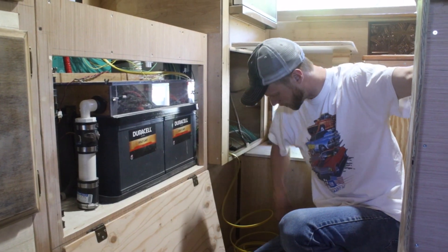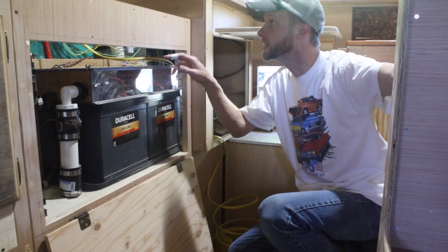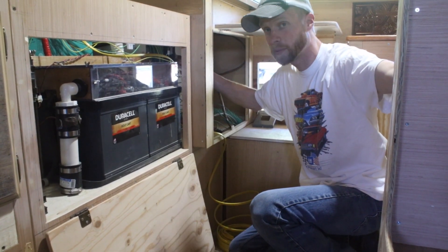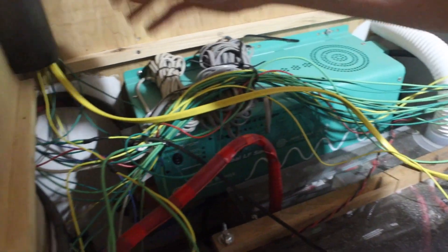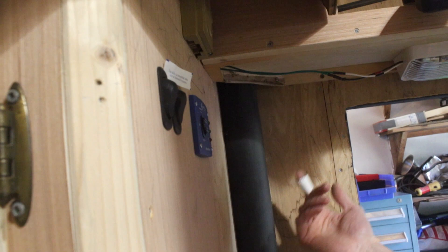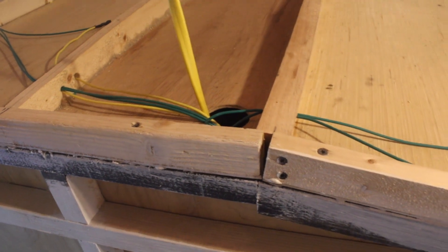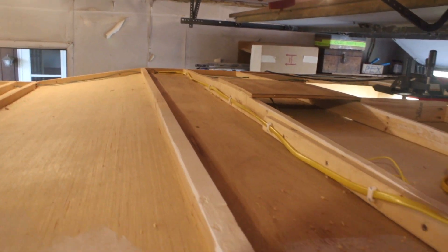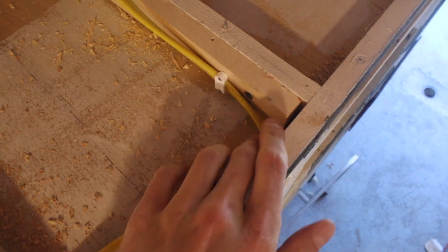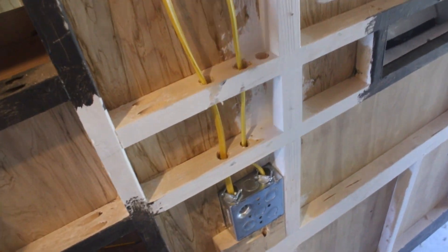We're at the stage where I've got the Romex 12/2 wire that I'm feeding through where the electrical panel is — feeding it through right here, which is the wire chase I have. This is where all the electrical runs, and a lot of it goes up into the ceiling or the roof. I've got to go all the way up and around and come back down. Got the wiring coming out of the top of the wire chase into the ceiling, comes down, I drilled a couple holes here, and it drops down and goes into the electrical box.